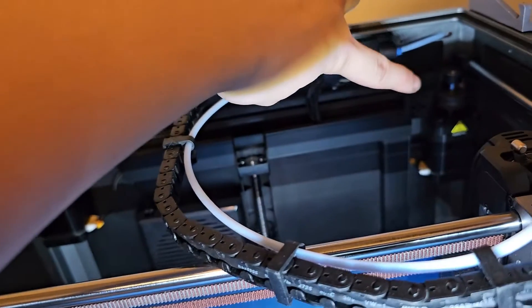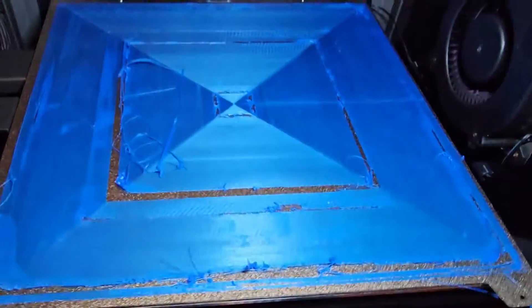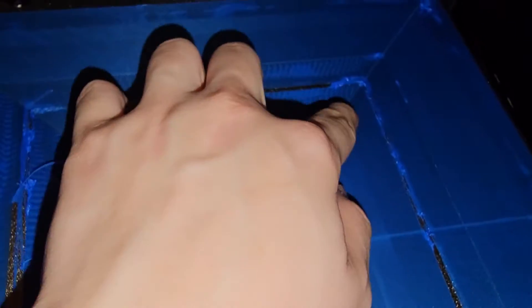Maybe I need to grease these two motors — do I just put grease on and hope it works, or take it off and grease it properly? Okay, to summarize exactly what happened: in the middle I printed with no changes. When it got to the next section I tried moving the bed up and down with the Z offset arrows. I reset to zero and then found the perfect Z offset and used that for the rest. But for these sections, it looks like the belt might be an issue — you can hear when it comes to this part it's like something is getting stuck.